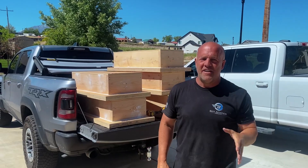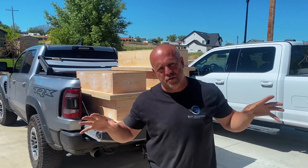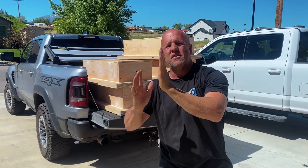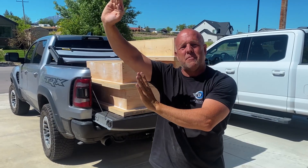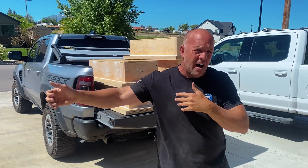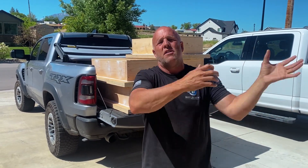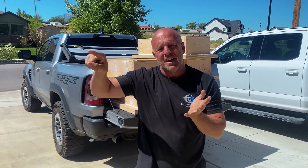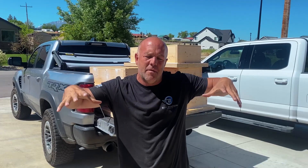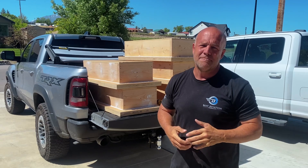Those holes actually aren't needed, especially on this narrow of a window, but I've had bigger windows have problems when putting mud under them. If mud comes in from one side and you keep filling down the wall, the concrete will slide across under the window, and if you fill it until the concrete starts coming up the other side you won't get a void under there. But sometimes when you're on a tall wall with a big pump truck and a lot happening at once, people put mud down one side of a window then move to the other side, and the mud hits in the middle creating a little air pressure zone — a little pocket. The air usually gets out pretty easily but with tight forms sometimes it doesn't escape well. So I just put little holes on top so that the mud as it squeezes together can get up to the bottom of the window. Probably completely unnecessary, but it only takes a few seconds.